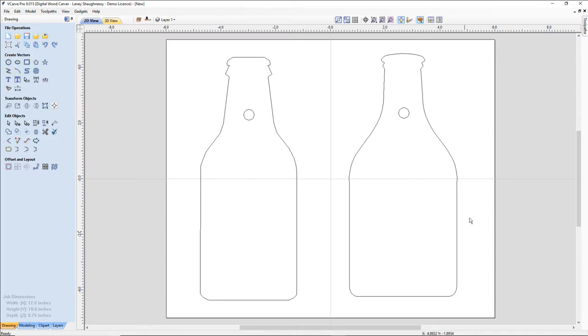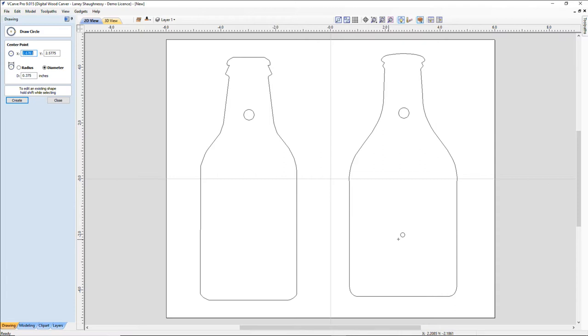But anyhow, depending on the rare earth magnet or what have you that you're going to use, we're going to be carving a pocket out, and we're going to nearly be penetrating through the material. But we're not. We're going to leave some skin on that front, enough that the magnet can still attract. When you pop those bottle caps off and that bottle cap falls, we want that magnet to pull and stick to that. Some people put the magnet in the front where you can actually see the magnet. I like it to be hidden.